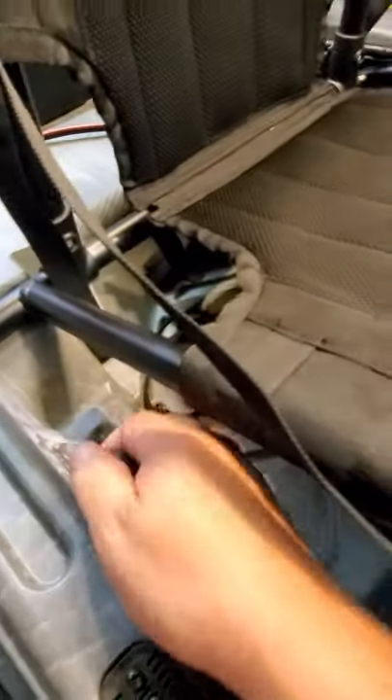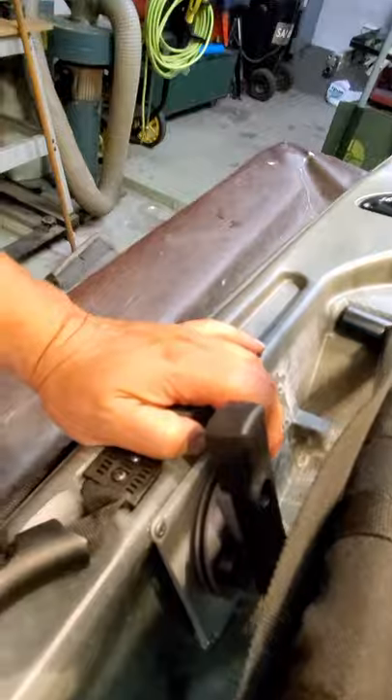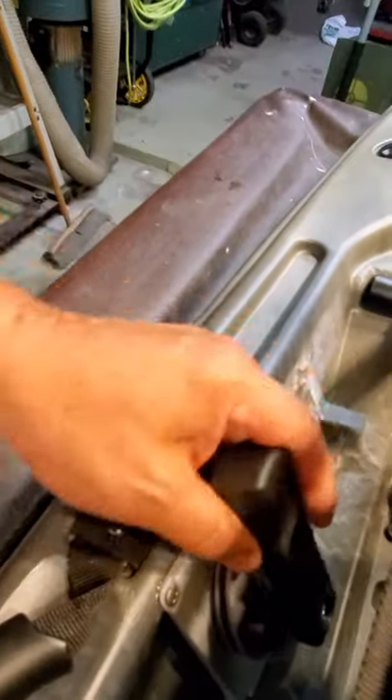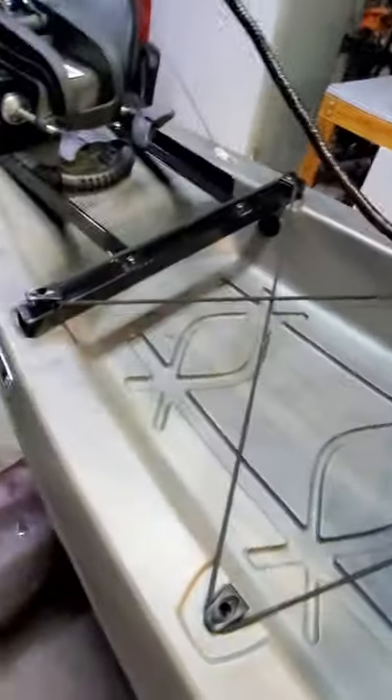There's my steering unit — you can see I'm turning the kayak. It's called the Vive Steering. I built it with a control box lid — I used the lid and mounted the steering unit to it, so I didn't have to put a big hole into the kayak. You buy a junction box, an extra one, and the lid comes with it. Then I drilled holes for the quarter-inch tubing and the string it comes with. Got my battery there. Got some flush-mount fishing rod holders — badass.